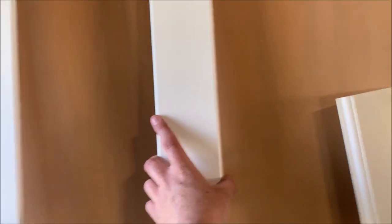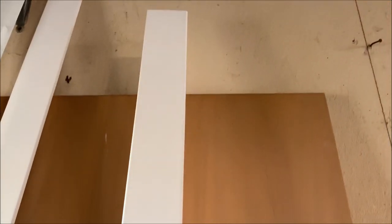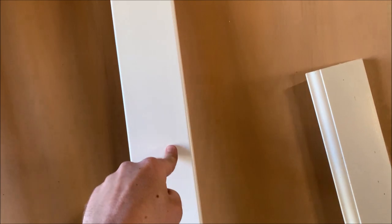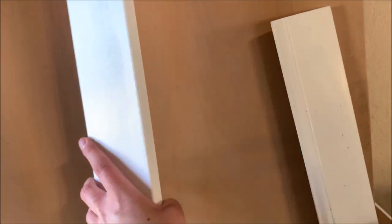I'm just going to have to do a light touch-up over the nail holes once they're in. This is baseboard material — it is half inch by three and a quarter inch. I got lucky because three and a quarter inch is exactly what I need. If you had to cut it down, make sure you cut all of them on the inside, meaning the cut part will be touching the window and not facing out — much less prep work because the back is unfinished. I got it at Menards. Let's grab one and start cutting.